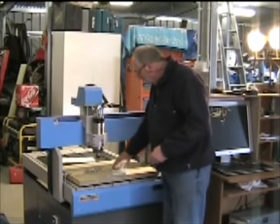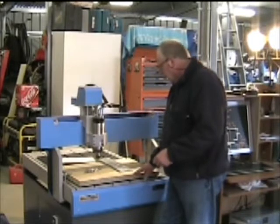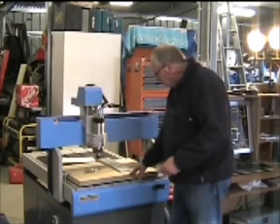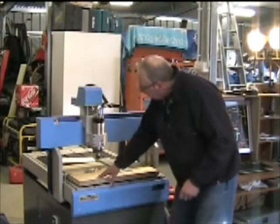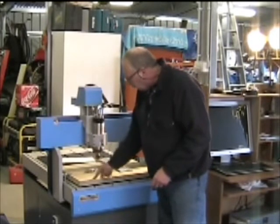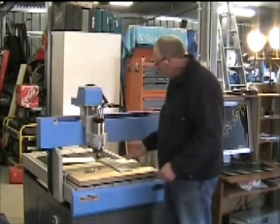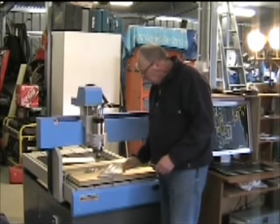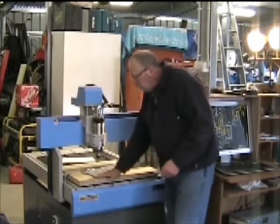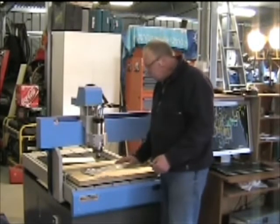So what I've decided to do is use some slabs of chipboard left over from a kitchen renovation. I've clamped this down on the table, and I'll rout out some grooves and drill some holes through to put the T-bolts through and clamp the workpiece down onto this. I'll make this a semi-permanent fixture when I'm doing metal jobs, and when I'm doing wood jobs, I'll take this off.